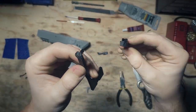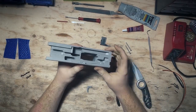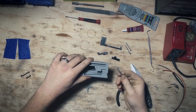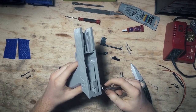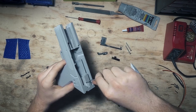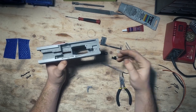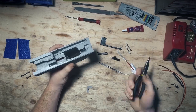Lastly, the trigger — for the same reason as the pusher link — just needed a little bit of material taken off so that it'll slide down there easier later. So I'll go ahead and start working on this handle and get it nice and filed down so all the parts will work together nicely. There was still a little bit of support left underneath this ridge that was causing the pusher to be a pretty rough fit. The overall rule for this trigger assembly process is you've got to guess and check — file a little bit, put it in and check how it works, find where it's rubbing, take it apart, file it down again, and give it another shot.